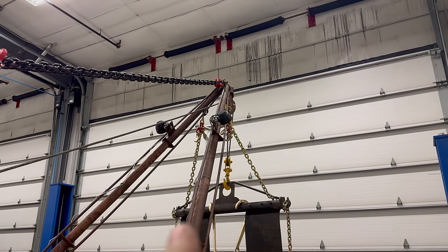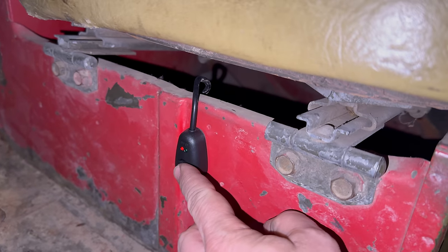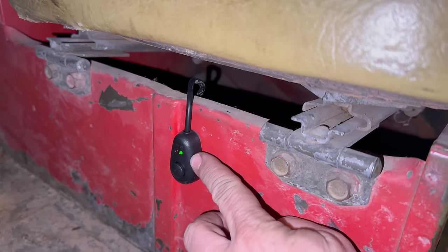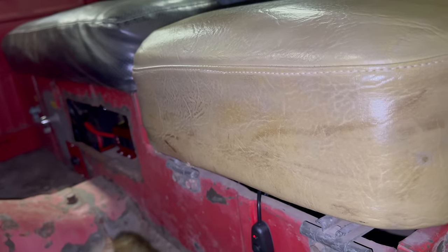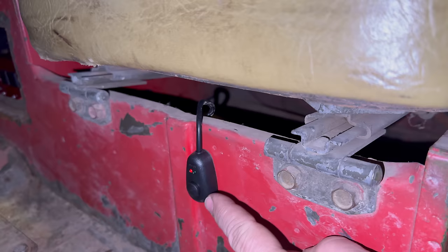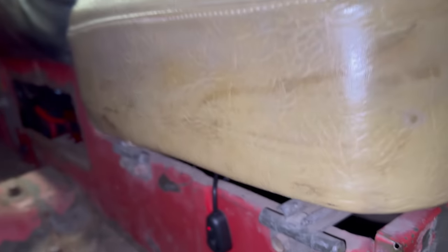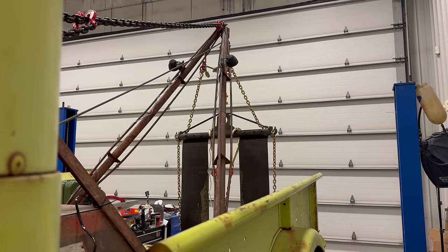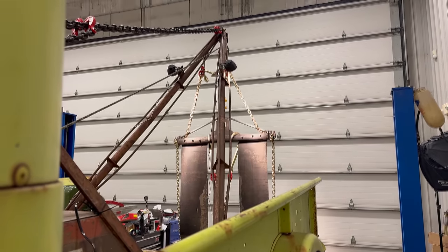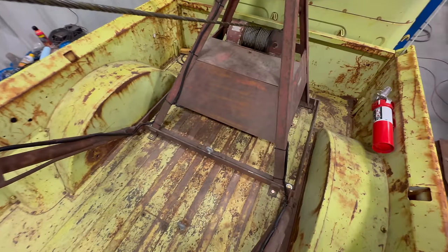The lights are up here on the back of the boom — where did I put the switch to turn those on? I mounted the switch here underneath the seat. It's red when the lights are not on, and green when the lights are on. These are also activated by the kill switch for the winch, so if the winch is turned on we'll see light here. I don't have to worry about a light being on all the time because I plan to have the winch kill switch turned off most of the time. You can see the boom lights turn on and off — I think that's going to work really well.